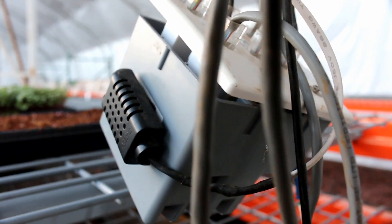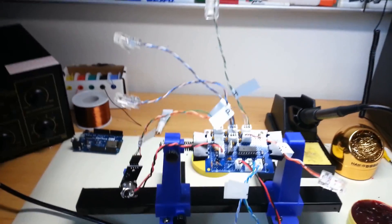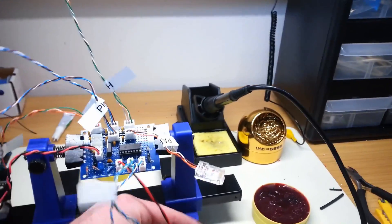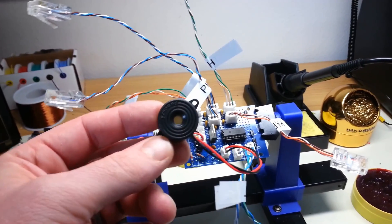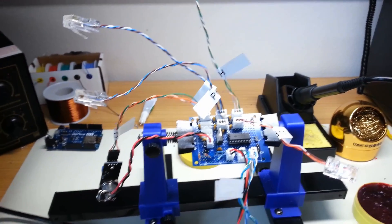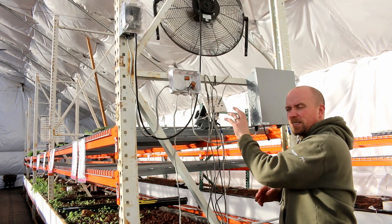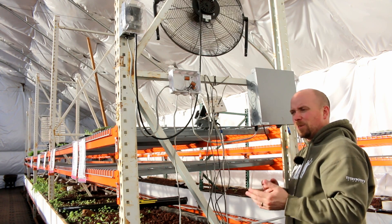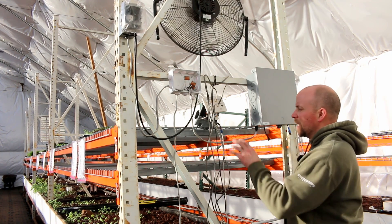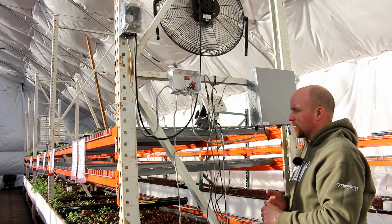We have a space for ammonia and nitrites in the future, but I don't have those sensors chosen yet. Inside we have another wireless command unit, and sitting on top of it is a custom circuit board. You can go back to my previous videos to see me build all these. We built a custom circuit board - it's an interface board that allows all these different types of sensors, which have different inputs, different capacitor or resistor requirements, to come together and get into the wireless control unit.